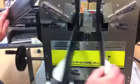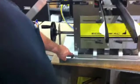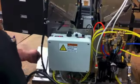You have to loosen these four handles. These two on the back. Crank this handle back to the blue mark. I'm going to have to show you this. Move that screw. Put in the other elevator plate, they both have marks. This one's marked blue, the other one's marked red. And those are all your adjustments.